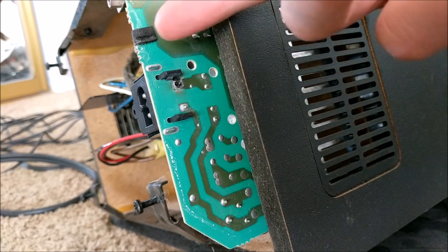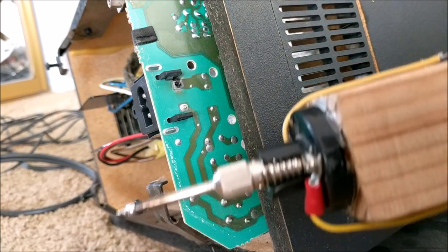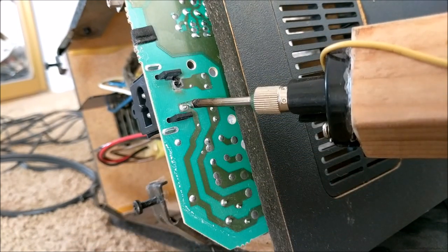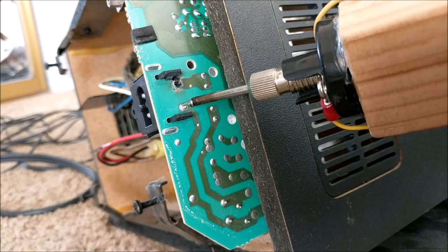This is a big problem we'll have to fix on this audio connector. It also shows what the problem is on the connector at the bottom. There's a high probability that the issue with this audio unit was that the solder was poorly applied and there wasn't enough of it, which caused arcs and the solder to vaporize around the connector plug. So theoretically, if we just replace the solder on both connectors, they should work just like normal. That's what I've got this little portable soldering iron for.